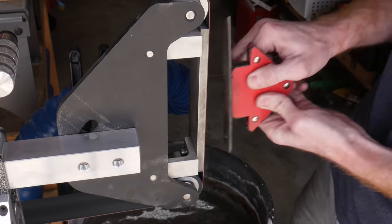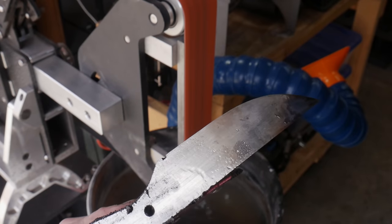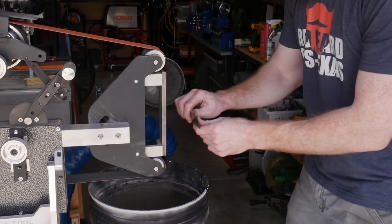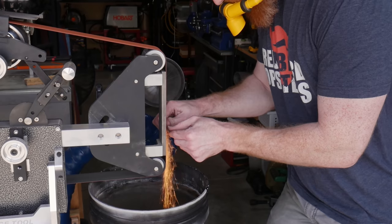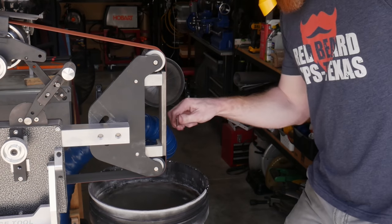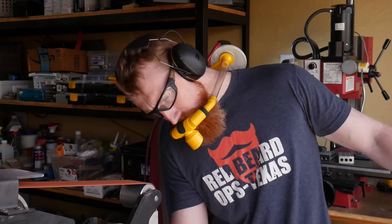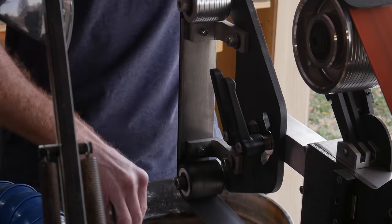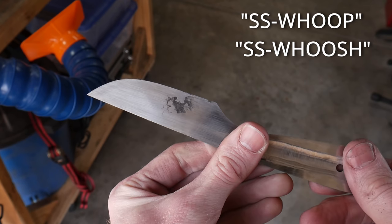One technique that I use that may be seen as controversial is tempering the blade on the belt grinder. Many knife makers may not like this technique and that is just because they generally do not have the skills to properly temper the blade on the belt grinder. By grinding so hot the blade loses some of the hardness from the heat treat but makes it a tougher knife in general. I have also been experimenting with some alternative grinding techniques. While most practitioners will tell you to pinch your elbows at your side and use your body to move your blade instead of your hands, I've been pushing the blade all the way out in front of my body and also grinding with one hand. I find that the one hand technique allows me to give a little bit more life into the blade and a little more finesse into the bevels. From this point forward I dub this grinding technique as flow grinding. While it is way harder to learn, I really think it will catch on in the knife making community because, as Kyle Royer says, it produces a faster knife that has more swoop and swoosh when used in the real world.